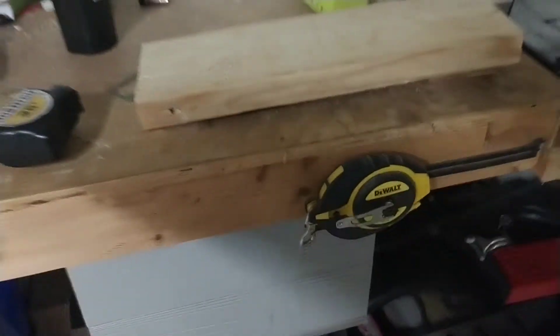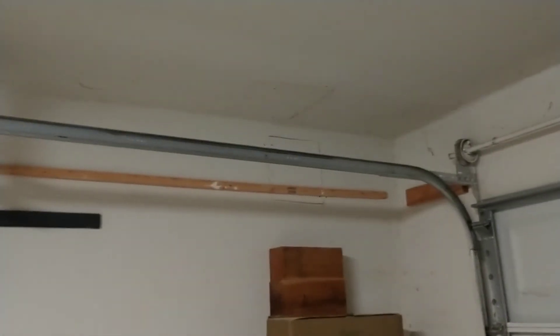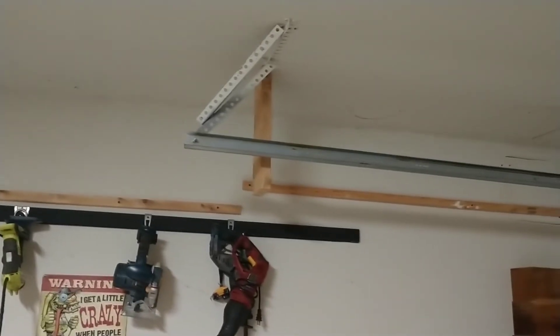Making sure I'm getting a good grip on the ceiling joist. I don't need to use a 2x6, but like I said I'm using scraps and this happened to be about the right size. I'll get that screwed in and put the other piece in for the corner. We've got three support pieces in place — looks a little weird right now, but I used my square to make sure it was square with the wall. Now I'll measure the distance between the two supports, cut a 2x4 to that length, attach it across the bottom, then level and attach another piece about 12 inches from the ceiling.